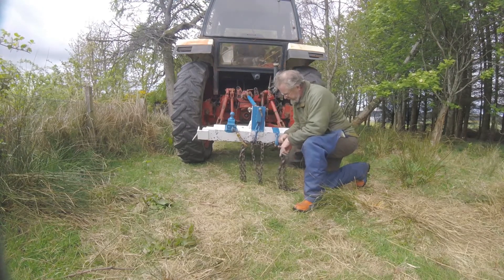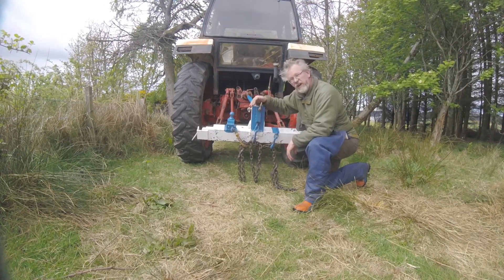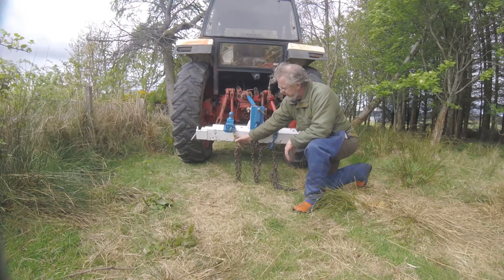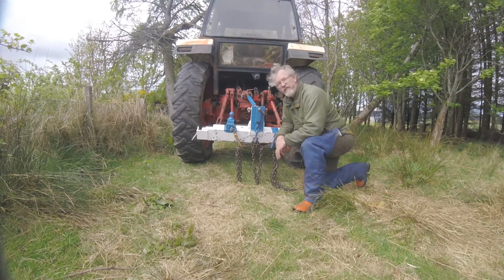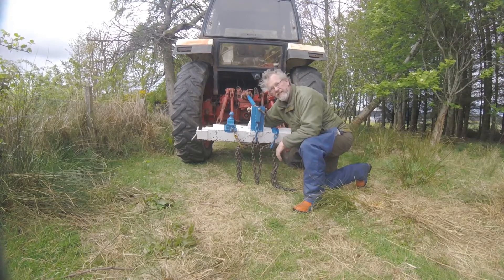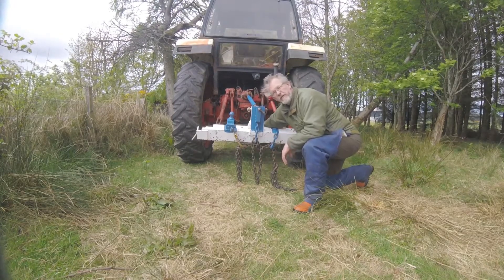I've put three chain hooks on. There's a top link d-ring there if I want to pull anything a bit higher. With the hook link and use of this chain, I found that I can pull out three trees — three logs at a time anyway. I'm still using my draw bar at the back here if I pull down a tree or need to pull out a full-length tree that's stuck and it's going to put a bit of load on. That way I'm always pulling from the lowest point on my tractor.